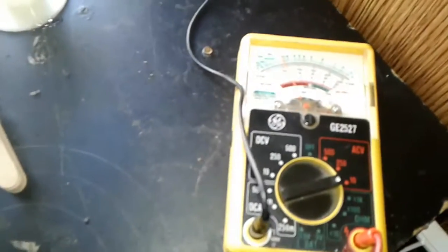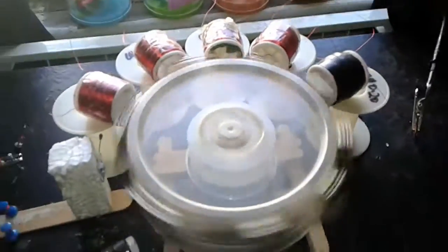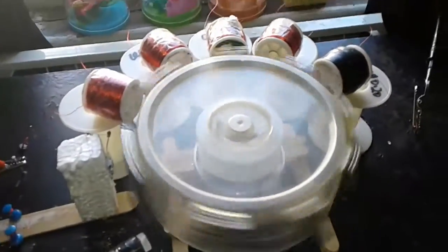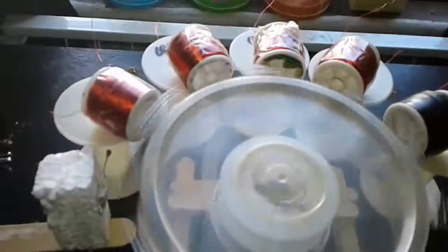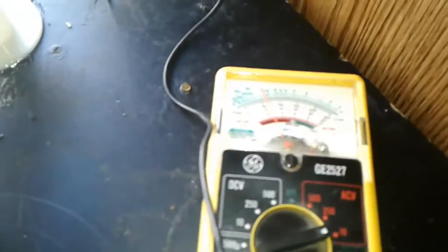Now you ask, why do you build this? What's the process? Why do you need to continue with this? Because folks, like I said, I'm trying to get this to power back at 5. If I can reach 5, I know she'll run at that speed. Problem is at the speed and the RPM she's at, and at the weakest magnets we got right now, and the smallest copper wire I could find, I think it's like a 30. The only copper wire I can find. It only makes it up to 3 volts at the moment, so I need more.